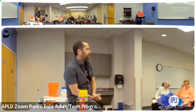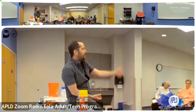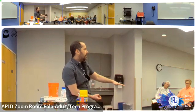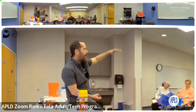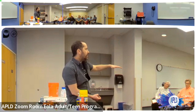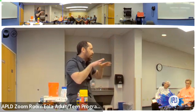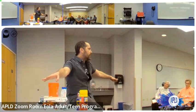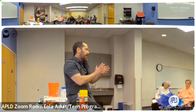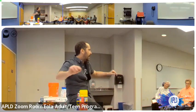What causes the water to come into your basement? In a lot of homes, hydrostatic pressure. Remember, your basement wall is below grade. The water is going to build up in the ground. It's quite a bit of pressure pushing against that wall. So when it gets real wet in your ground, any leak, any cracks are going to leak through. The real key to keeping water out of the basement in a situation like that is good drainage. Once there's a crack, you have to deal with it. But the best way is to maintain good property grade and solid drainage.